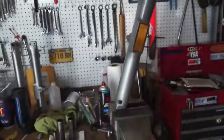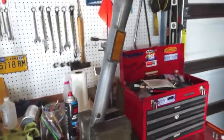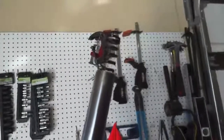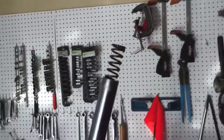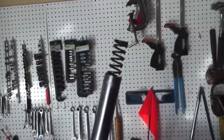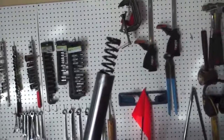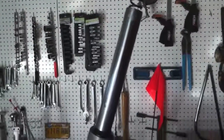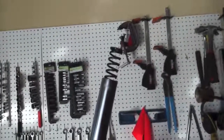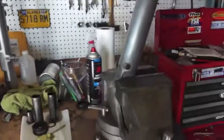Here's the second one — I've already done the first one. The first thing to do is take that cap off. Loosen it up while it's in the fork, in the triple tree, because then it's clamped and you can loosen it. I loosen it with an impact wrench, just because I love my impact wrench. And then put it in the vise so that it can drain.